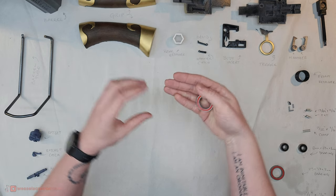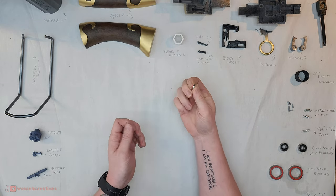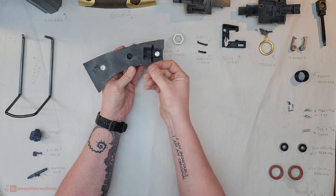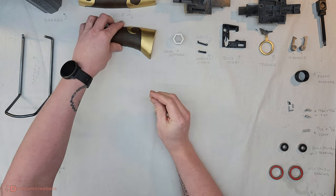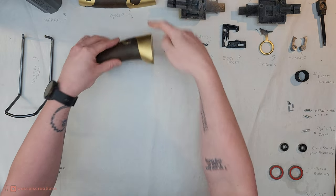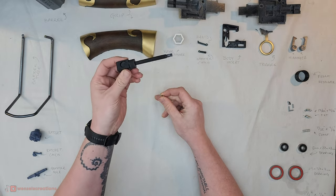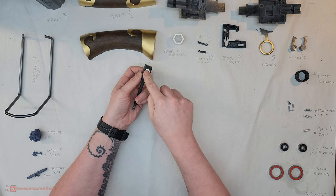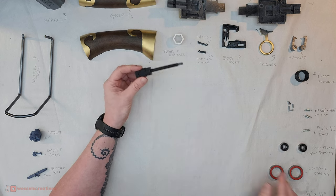The barrel wants to bend and that causes binding, so those extra bearings were a necessity. There's also a bunch of magnets — half-inch by one-eighth-inch neodymium magnets. Each part has spots for three magnets, but I found you only really need two. There's another spot for magnets on this side which interfaces with one of these, and the back ones interface with each other. There are also spots for magnets on the inside here. The way mine printed, they go together with enough tightness that I haven't needed the extra magnets yet.